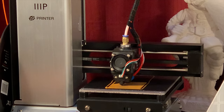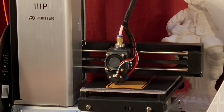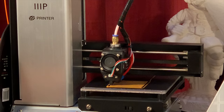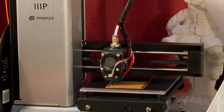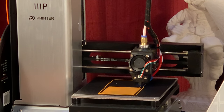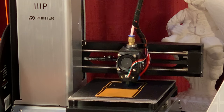I'm landing right about minus 0.82, and I'm really starting to like what I see — so that is going to be my magic number. Of course, if I switch my bed to glass, or if I remove the BuildTac surface and go to painter's tape or something like that, my number is going to have to change to reflect that change in thickness of the bed. But other than that, minus 0.82 is going to be my setting, and I should have no problem with my prints. If I do, it's probably more indicative of a dirty bed than anything else.